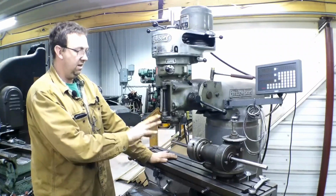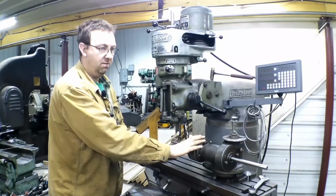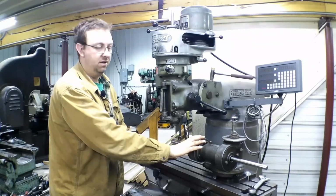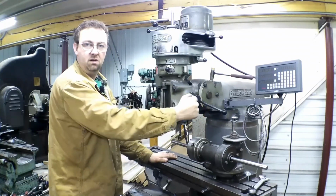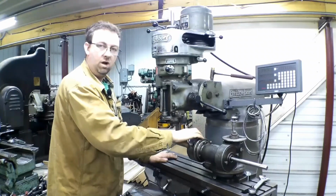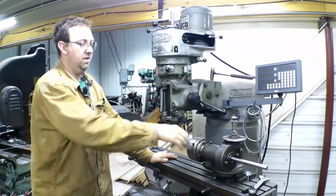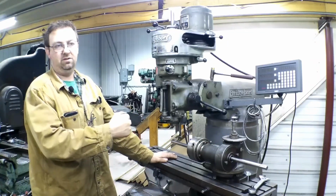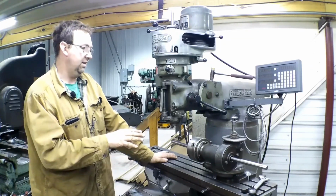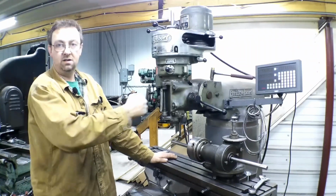A dividing head, I want to talk about this a little bit. Almost every dividing head I've ever used, and they should almost all be this way, though there are a few that are a little different, is 40 cranks on your plate to one complete revolution on your spindle. So it's 40 to 1, and these dividing plates are so you can do multiple locations. There's a lot of calculation to it. I'm only doing four positions, four features, so I need 10 complete cranks.